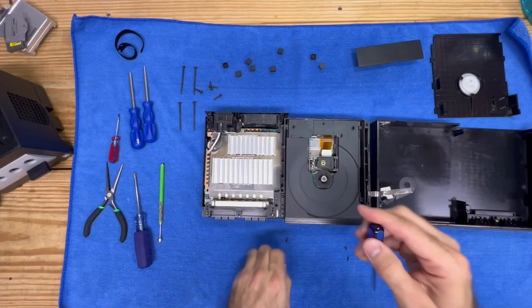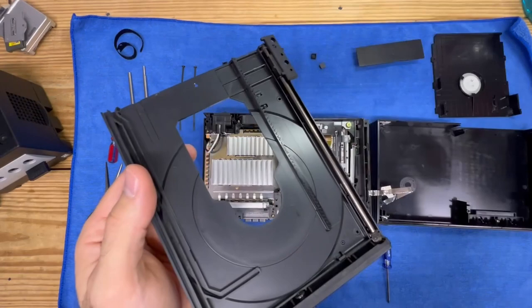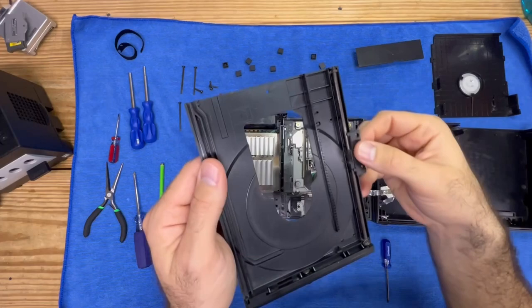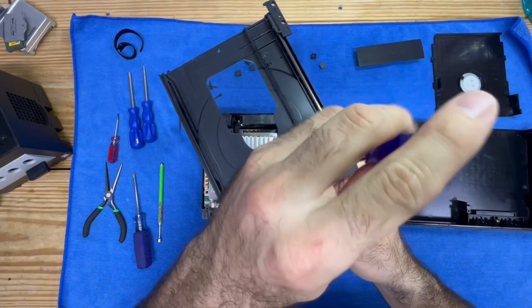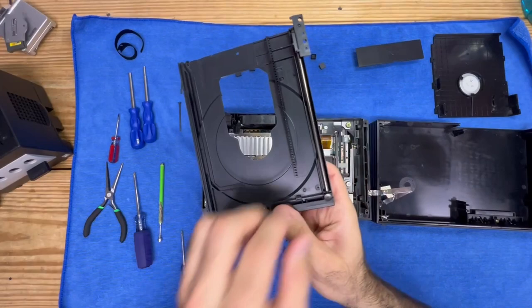Here is the first metal rod I was telling you about — let me get better lighting in here. That rod slides but will make that noise. In order to release that rod, we're going to take off this screw right here. All this is is a retaining screw to hold that rod in place, and by taking that off we now have access to the rod.